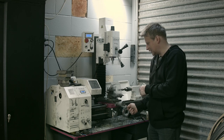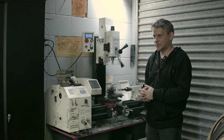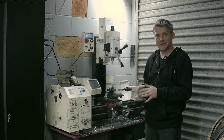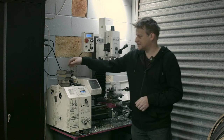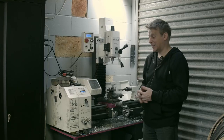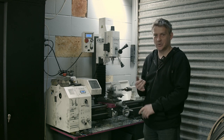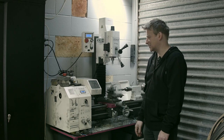My next adventure: I was milling something, moved it back, and the machine stopped. I was wondering what the hell - did I kill it after five days of very light milling, mostly testing? Turns out the emergency stop button melted. I took apart the whole machine thinking I killed the motor or the VFD, but yeah, it was the emergency switch.